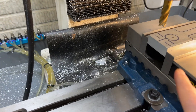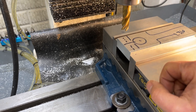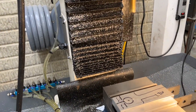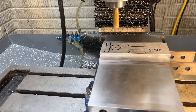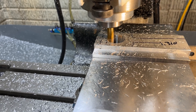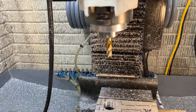I got my program all set — you can see all the tool paths. Using a half inch end mill, I have it centered on this edge and centered right in the middle, so it's gonna come over 1.4 something and bore that out right there. Let's get this going — hit cycle start. Beautiful, all right.